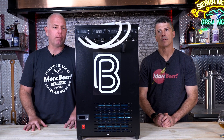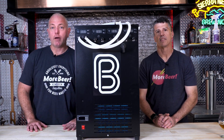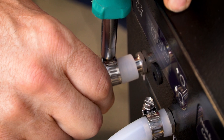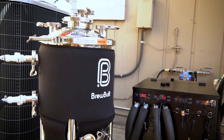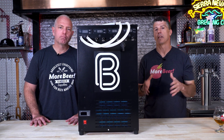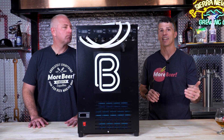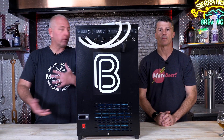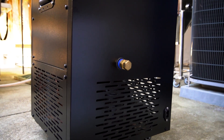It's a pretty basic concept, but it kind of seems like a big glycol chiller — it's really easy to wrap your head around. The fun part is it's fast. When you have a super cool liquid, we're talking negative degrees Celsius and Fahrenheit, trying to hold 68 or 70 is no problem at all. And when you want to bring it down to cold crashing, it's even easier than most other forms of chilling. You can get there quicker and more efficiently — down to 38 or 34 degrees Fahrenheit to truly cold crash.